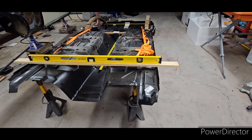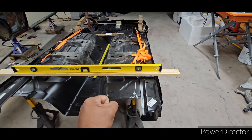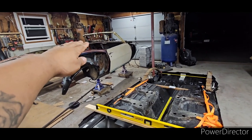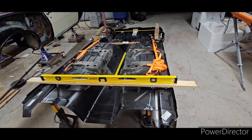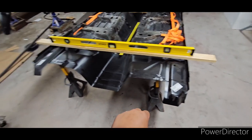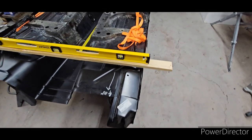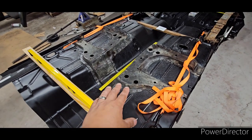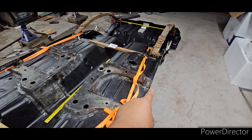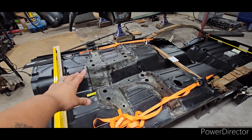This being a convertible, your floor will have a brace. This is for the first gen F-body convertible cars — you have extra bracing on the car because it needs to be more stable, more strong, more durable, because of course it doesn't have a roof like a coupe. So the floor being strong is even ten times more important than a coupe. By factory, they added some more bracing. These bracing go all the way to the front, and the end here hangs to your torque boxes — welded on the torque boxes. You also have this convertible middle section frame that I made a video on. This happens to be the original brace that came with this car — it just had the ends that were rotted and I had to cut it and fabricate them. I welded all this up yesterday. I lost count, but it's a lot of plug welds — a whole bunch of plug welds here.